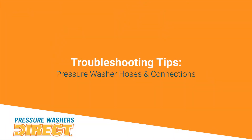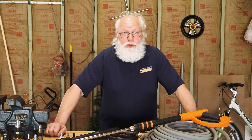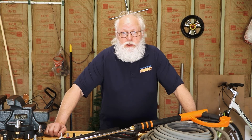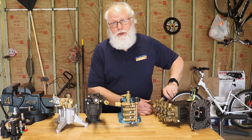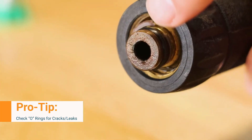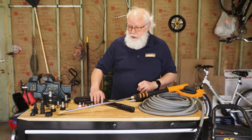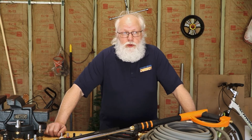If you're having problems with your pressure washer sputtering or getting intermittent pressure, there may be a leak somewhere — maybe you're not getting full flow from your hose supply, or there might be a leak in your high-pressure hose. That can be a sign of sporadic pressure. The unloader might have gotten turned down; you want to open that all the way up to get full pressure. Something as small as a split O-ring can cause big problems, so check your O-rings, check your nozzles, make sure they're clean, check all your connections, make sure everything's tight, and read that manual.